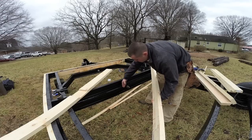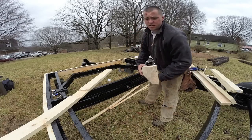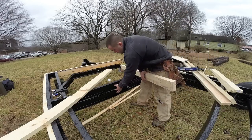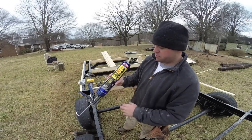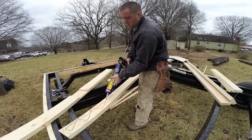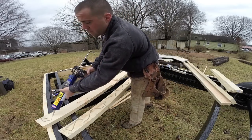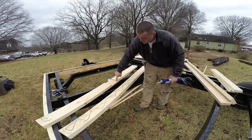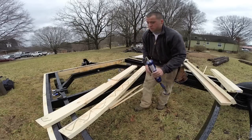I need to fill in this web right here so I can attach a ledger board to run my joists into it. So I took a two by six and I ripped it down on a twelve degree angle on both sides, making sure this dimension would fit inside of that piece right here. The construction adhesive I'm using is PL premium construction adhesive — I'm just going to apply some glue on both sides. On the other side there's a half inch steel plate so I had to notch this out. I just took a circular saw, set the depth to a half an inch, scored it a bunch of times, and then removed it with a chisel.